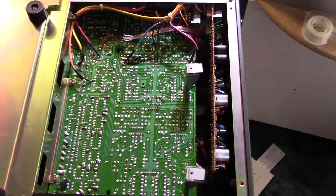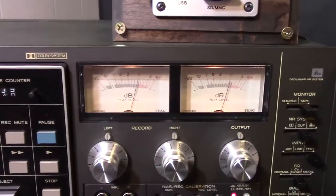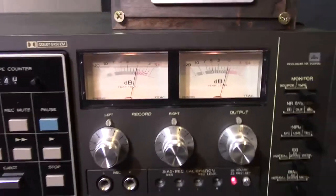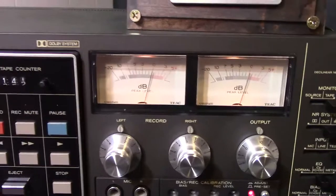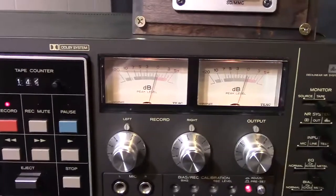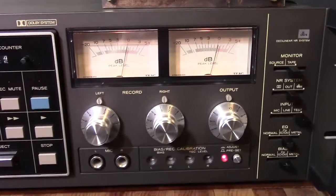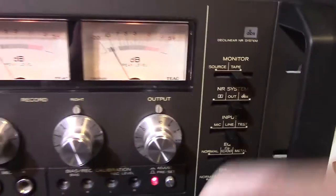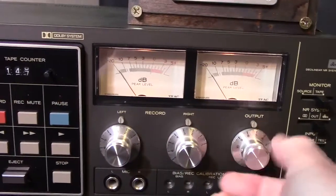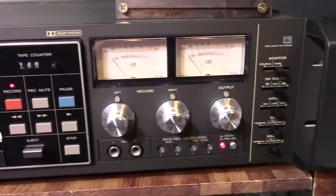And now we're back from that. This deck is completely calibrated. What you heard on the previous video was me recording a song by Deep Purple, playing back on this exact tape. I wanted to show you how to calibrate it and how it's done. Don't forget to take it out of test mode, because you'll jam the meter straight up if you leave it in — the meters don't like that extra sensitivity. Hammy Technoid says, see you later.